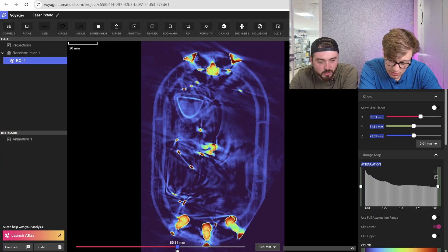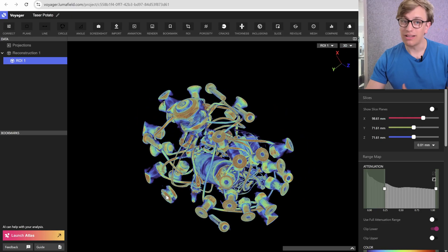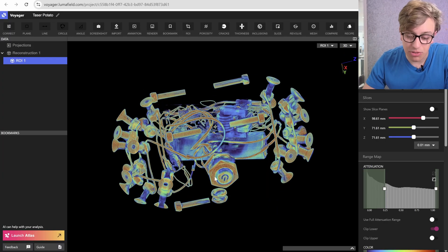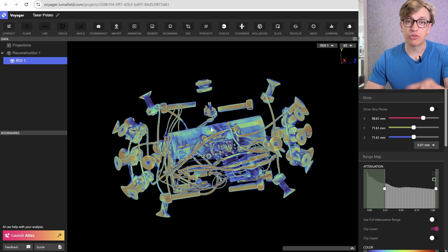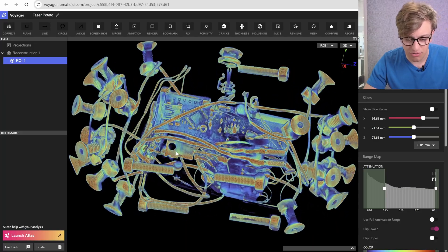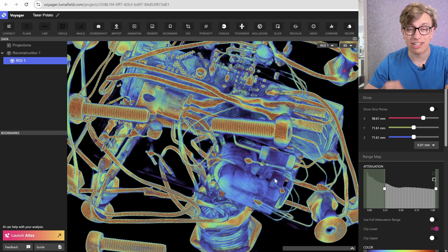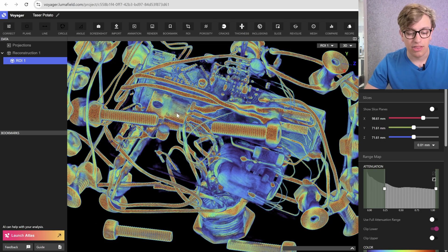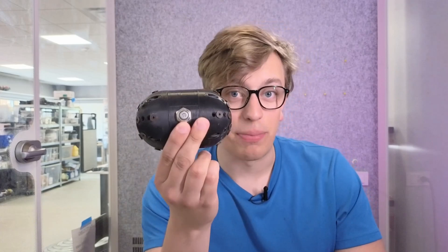There's not really all that much to it — it's just that every part of it is concerning. Or just how you know it's a good project. So all told, that is the whole adventure. The thing's powered by a battery, charged through this plug. That plug has broken, which is why the potato no longer works. That battery is switched by this power switch, which when active delivers power to a 5-volt boost converter that powers the microcontroller. The microcontroller starts a random timer and eventually turns on and activates this MOSFET right here. When that MOSFET fires, it connects the negative input power terminal of the high voltage power supply to ground of the battery. The positive terminal is always connected because this MOSFET is isolating it via the ground pin. Then it turns on and delivers power to some collection of these pins, so that you can shock the bejesus out of your friends.